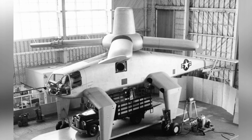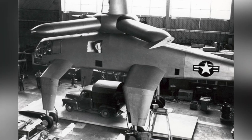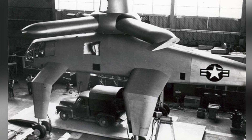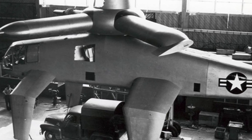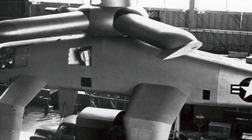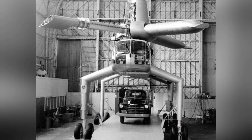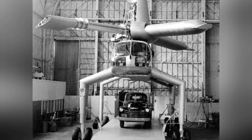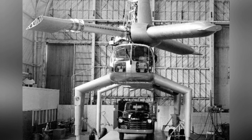A portion of the power from the gearbox was transferred to drive the tail rotor at the rear of the tail boom. Compressed air was delivered through pipes inside the rotor hub to pipes inside the rotor blades. Both the rotor hub and the rotor blades had a fuel circulation system, and the rotor blades had multiple nozzles at the end for small combustion chambers on the sides. Compressed air and fuel combined in these chambers to produce thrust, driving the entire rotor system.